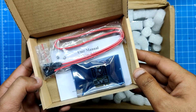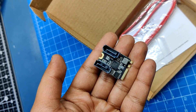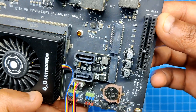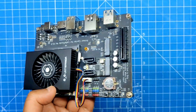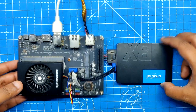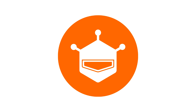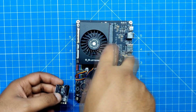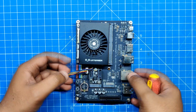Now this is an interesting little adapter — the M.2 to SATA dual port adapter. It is designed for devices that have an M.2 E key or M.2 A key but no SATA port. We are using this device because we want to use a SATA SSD with this setup. DF Robot sent one unit for the project. The adapter was positioned on the Latte Panda M.2 E key slot and fastened in place with the included M.2 bolt.